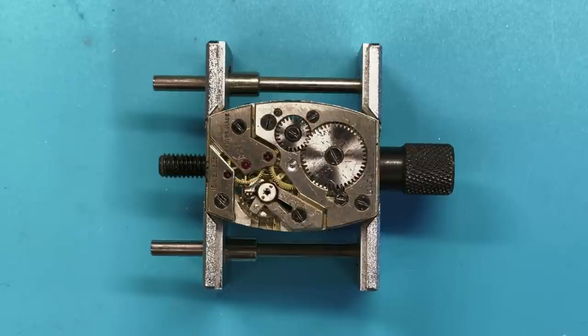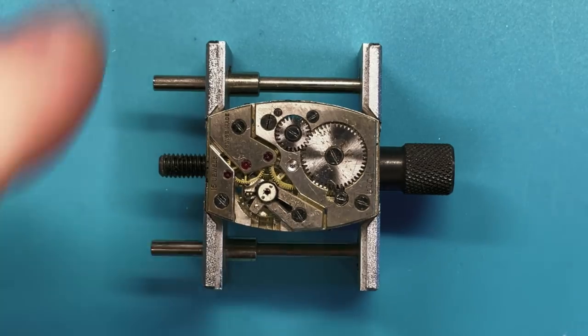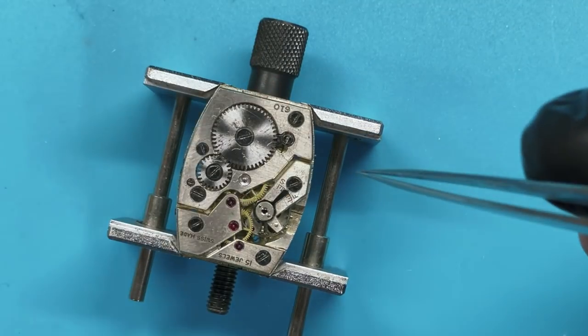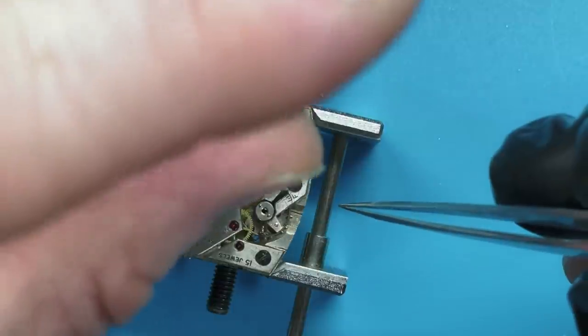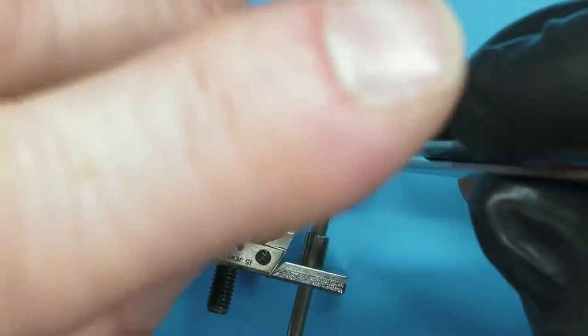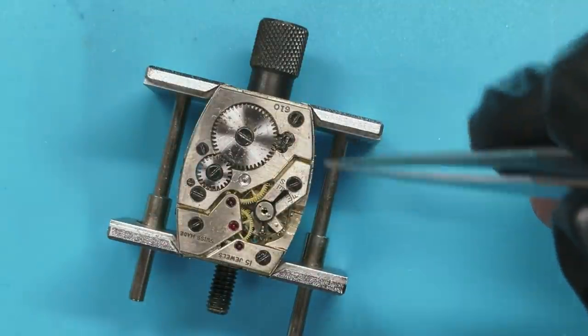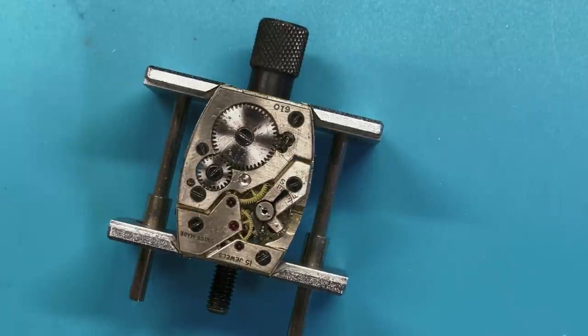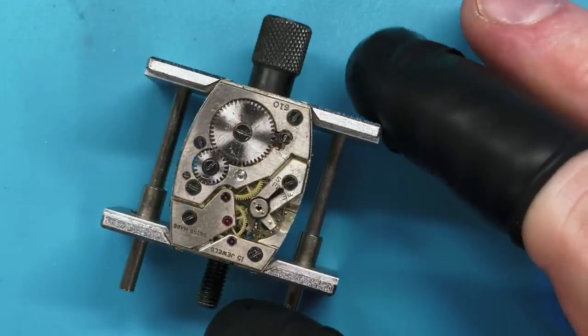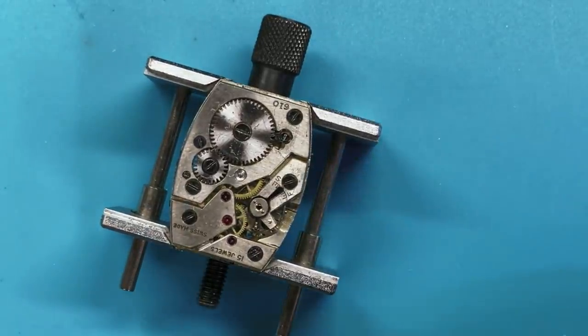And this should be a little bit more interesting. I've never worked on anything like this before. It's certainly a little bit smaller than I'm used to. So I need to try and let down some of the mainspring. And this never comes on very well on camera, but I'll try. And it's unwound itself in one fast motion, not desirable. Quite stiff actually to turn, so that could be an indication of a problem. However, there we go.